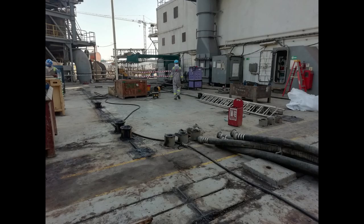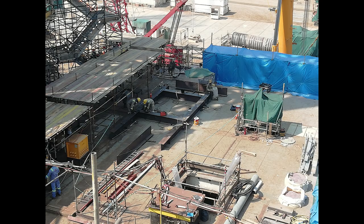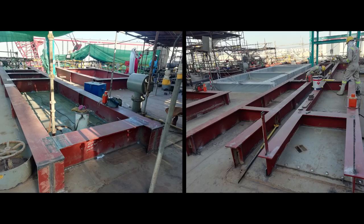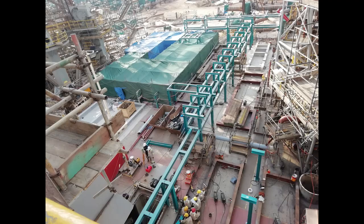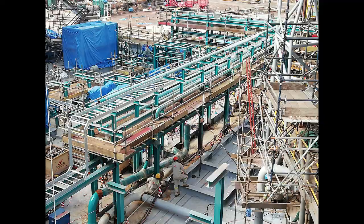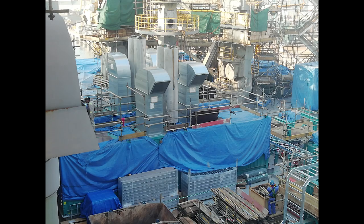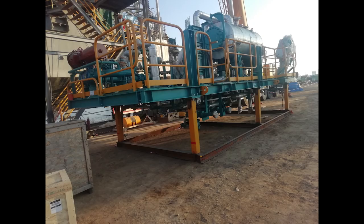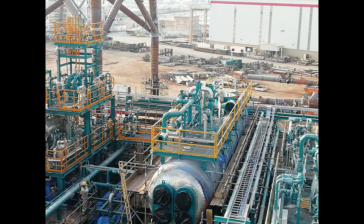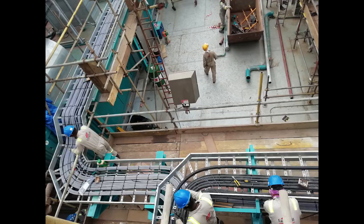The rig's main deck is cleared for installing the process equipment. Zentech designed the foundations with T-beams on main deck to avoid any underdeck stiffening. X-Pro delivered the pipe racks and spools, cables, and accessories to shipyard for installation. Process gas generators, separators, heater treater, compressors are delivered in disassembled condition. Process skids are reassembled, and integration is completed by shipyard.